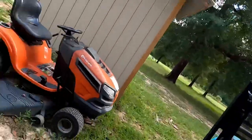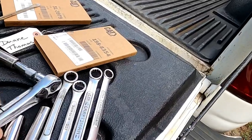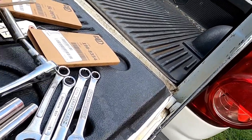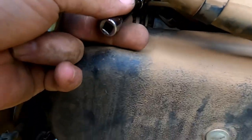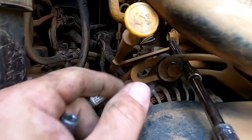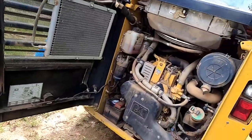Let me show you the tools I used. That screwdriver right there took that cover off. Then I had a combination of wrenches — 13, 15, and 14, with two 14s — and the same sizes in sockets: 15, 14, and 13. I also used this socket — took it off the ratchet, stuck it through here, and it rested on the bolt in the back. I was able to push on it sideways to get the tension I needed on the belt. That worked real good, that's why I have it. Alright, that's how I change belts on my Cat 259D.